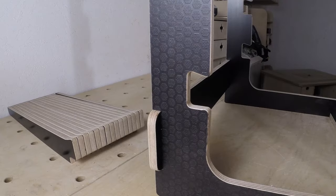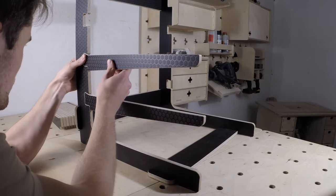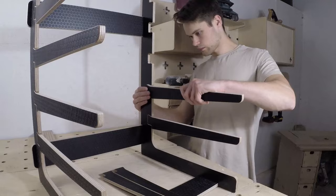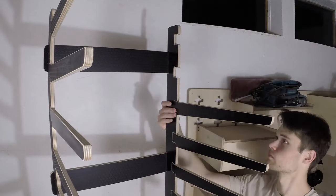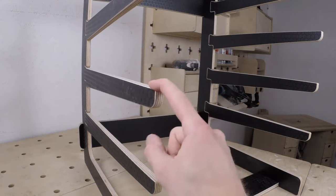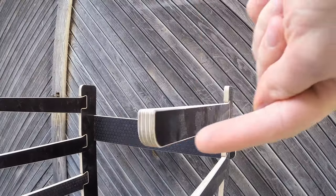This was easy — I would say too easy. The joints weren't as tight as I would have liked them to be. After a quick troubleshoot, I realized the bit I was using was 1/8 of an inch in diameter instead of 3mm. This meant there was a 0.12mm offset that made the parts slightly smaller and the dovetail joints looser, with some of the racks moving around in the joint. But it won't affect the functionality of the paint drying rack since the parts apply pressure to the shelves from the top, not the sides.